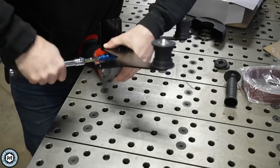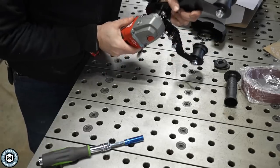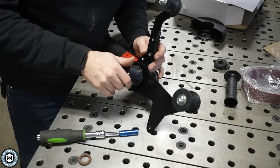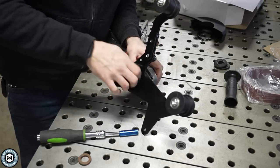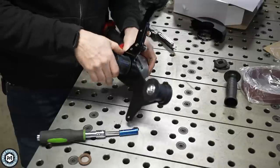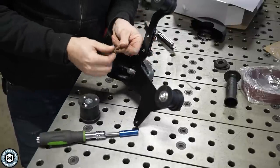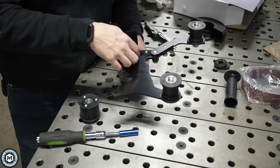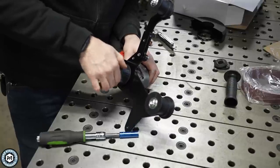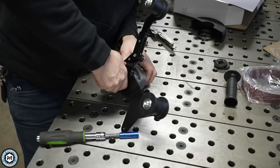We're going to stick that back on there and continue the installation with better hardware — this has to be tight because you don't want it moving around. Now that you've got the bracket on, when you go to thread your drive wheel on, the screws on the back will hit the frame. I resolved that with a three-quarter inch lock washer, which was the perfect offset — it gives positive resistance to keep this from bottoming out and keeps the spacing nice. I'll hand tighten this.